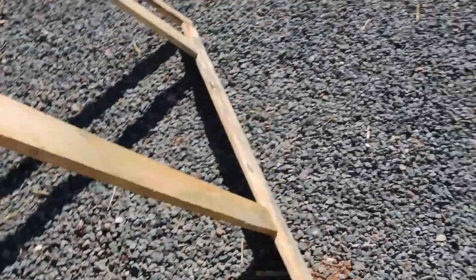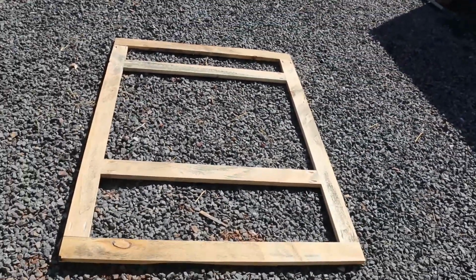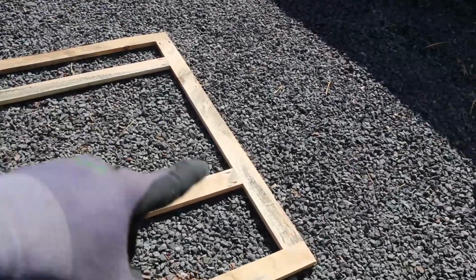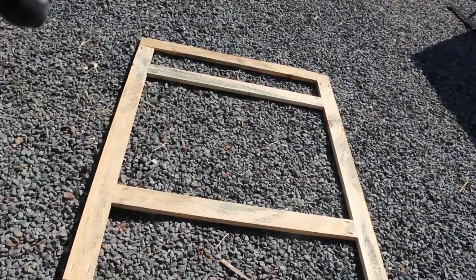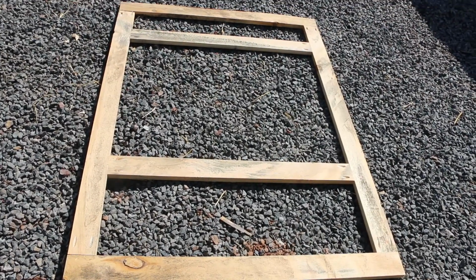We're going to flip it over, and then we're going to smack the sheeting, the plastic greenhouse material sheeting, to that side, the staples, and then we'll come around and fill in, screw another 1x4 on top of this 1x4, all over, cover these joints. Bippity boppity, we're done. All right, get to it.